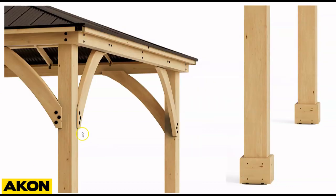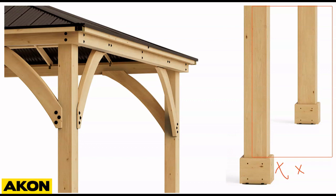So let's talk about the height. You don't want to measure from the beam right here, because it will actually give you a bend — if you lay vinyl from here, it's going to bend like this and you're going to have a small opening right there. So you want to measure right below it, and then go all the way to the bottom. You don't want to stop the height short, because if your vinyl only measures up to here, the small gap at the bottom will let wind blast in through there.